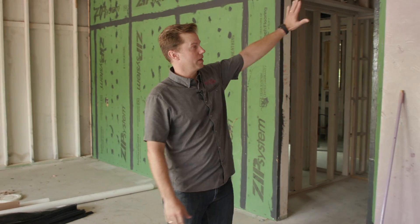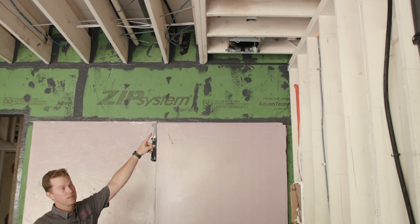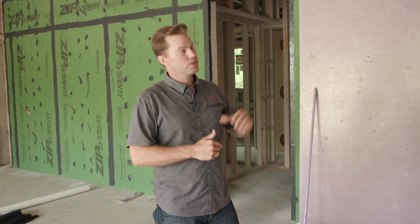One more thing about the garage — we're going to park a hot car in here that's off-gassing exhaust, and we've got gas cans, lawnmower equipment, paint cans. We don't want any of that in our home. So not only are we going to air seal, but an extra measure is installing this motion-sensored exhaust fan. On motion, when the garage door opens or you walk out, we can program it to run for about ten minutes at 60 CFM every time it trips. One extra step to get all that nasty stuff out and help with indoor air quality.